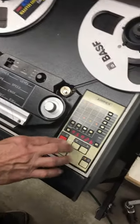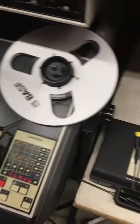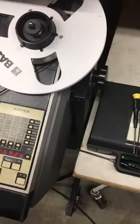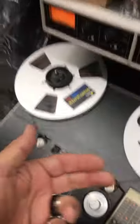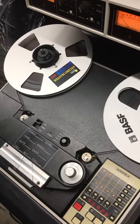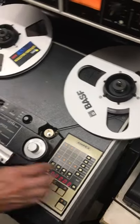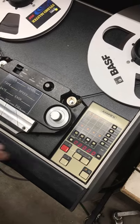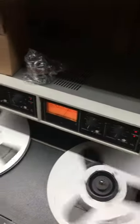Can you do four tracks? If you had four electronics, it was built for just that purpose. This is built for two channels — two tracks. They could have put another bank up here with a four-track head stack. This has two-track electronics and two-track heads. To record, you hit the record and the play. You see the red light comes on, indicating bias and erase, and we're recording this tone. If I turn the knob — there we go. That's what we're recording. Sounds like my tinnitus.